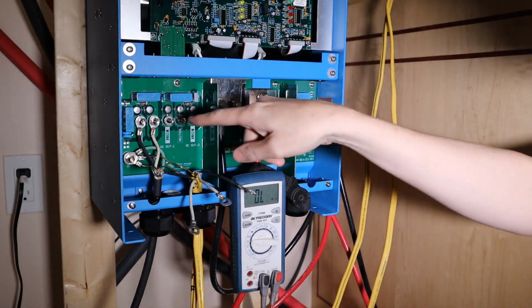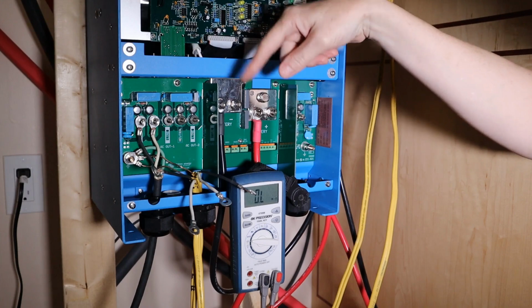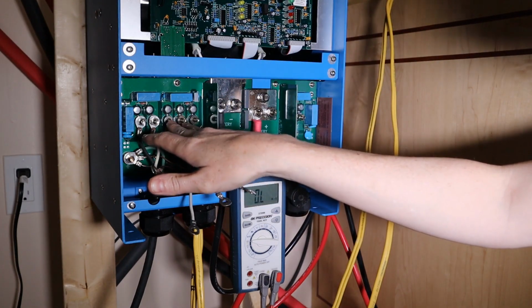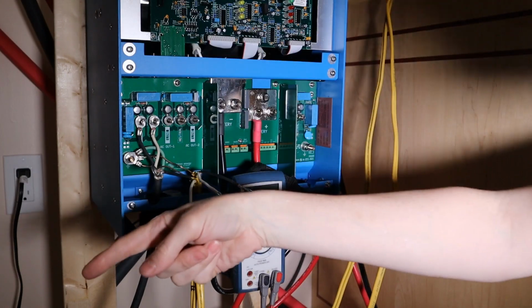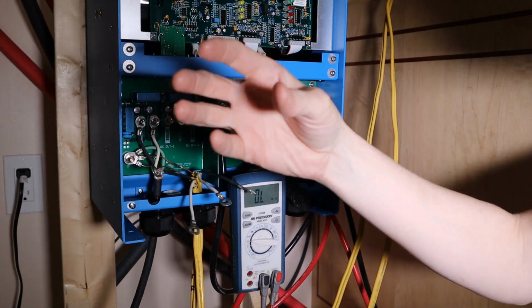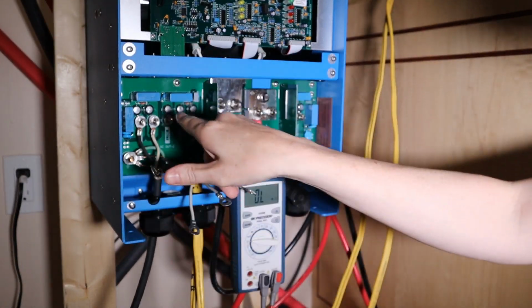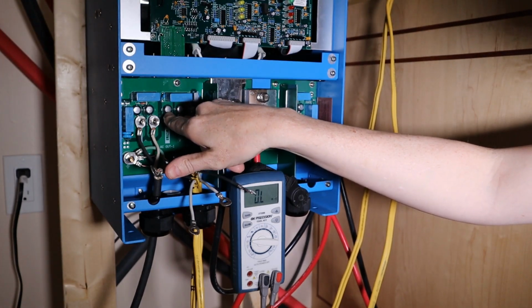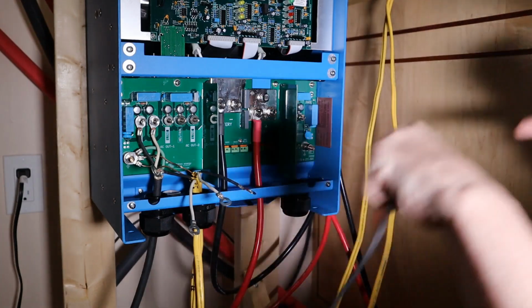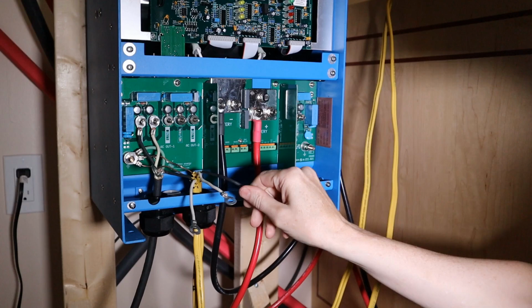I'm sorry. Basically, one wire comes out, wraps around the coil of the transformer, and eventually pops out the other side. That's fine. There won't be any power here until the other side of the transformer, the primary winding, gets power. When the primary winding gets power, it generates a magnetic field which will induce power on the output side. So this is totally fine. This is totally safe.